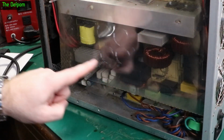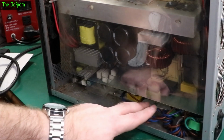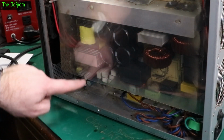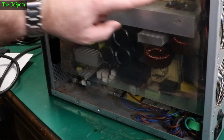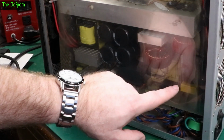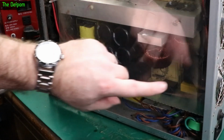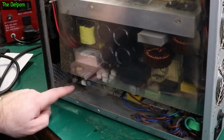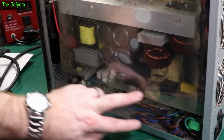And obviously you've got the main switch modes down here. We've got some smaller stuff here. Got one here. There's a couple of small capacitors down there. And it comes right across and there's more over here before we get to the big stuff. The big ones over here, this is obviously for main output stuff and the re-switching relays here too. So this is all the main output to supply the outputs. That probably isn't what's wrong. It's likely to be the primary supplies down here, which would be like a standby supply rails and things like that. So it's likely to be something in this area.